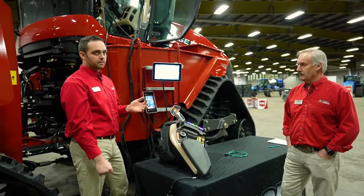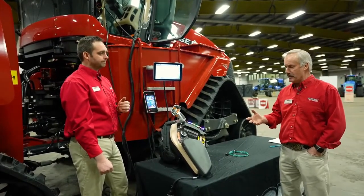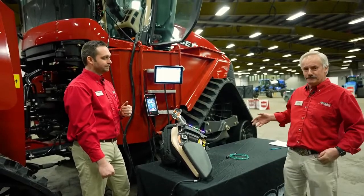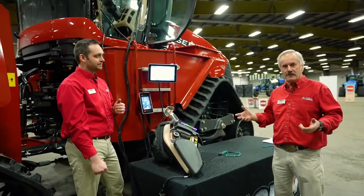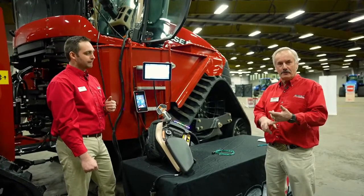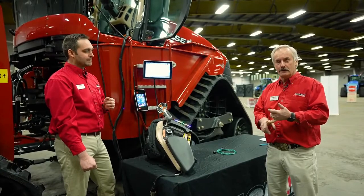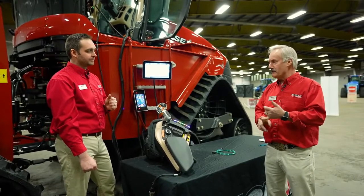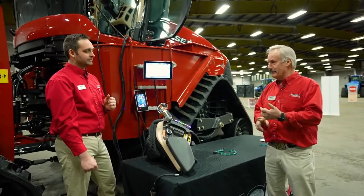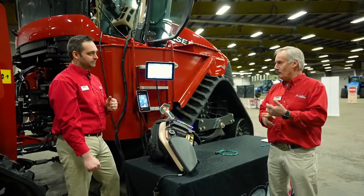take the time to set up your flows. So I got my air seeder behind, again, setting my flows. How do I do that? What's the procedure for setting up my flows? Okay, so you got functions back there. You got your lift and lower, correct? Okay, so now, does it take 10 gallons per minute to lift the implement, or does it take 20? Well, depending on the air seeder, I have no idea, correct?